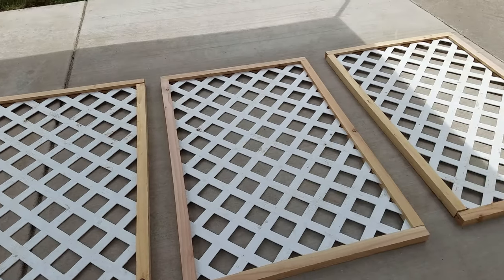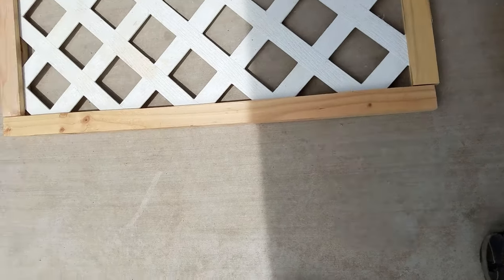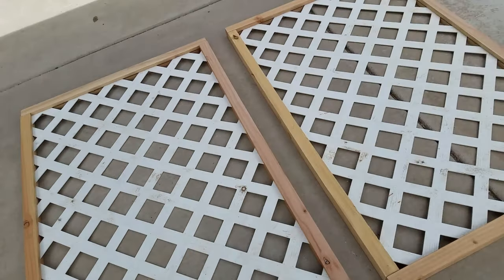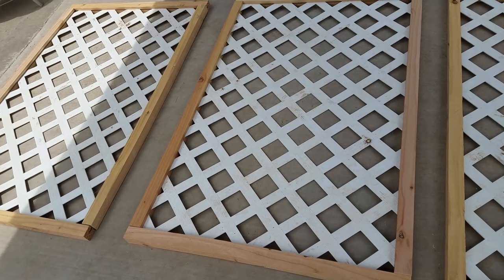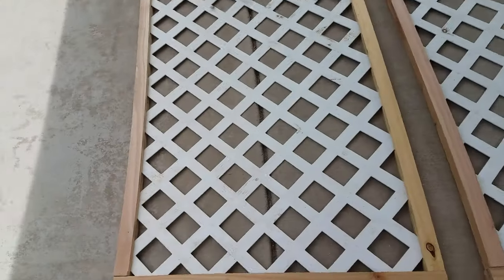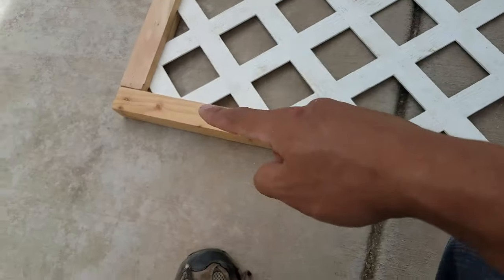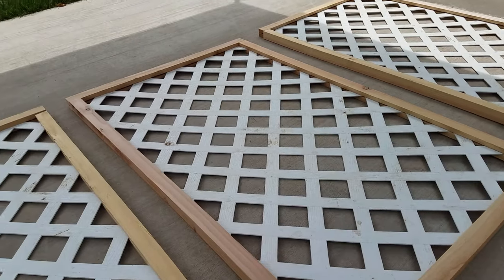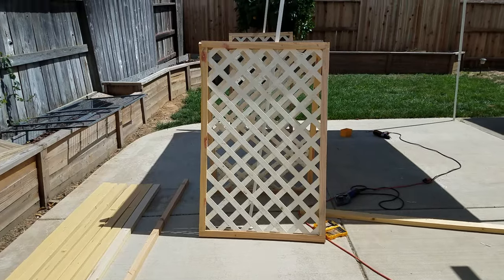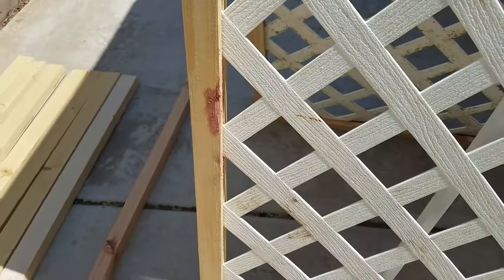And there were three. They still need some adjustment — on this one I need to fix it by cutting a little bit more off the lattice so I can push it in more and make it flush. So that's it for these. I have them labeled — I mark all the wood: A, B, and C, and then on the joints, as you can see, this is joint three of panel A — one, two, three, four — since I'm gonna have to take these apart and do some finishing work on them, so I know what goes where. So I got the panels mocked up and screwed on just so I can sand down and fill in some of the imperfections, since it's going to be painted.